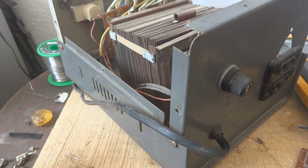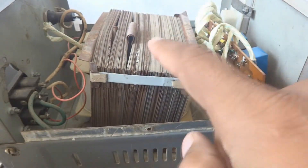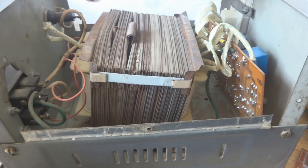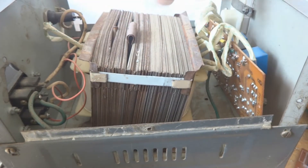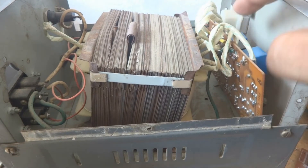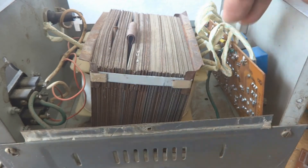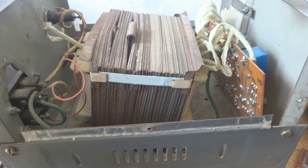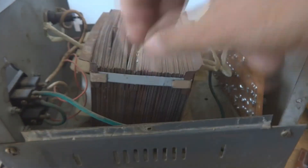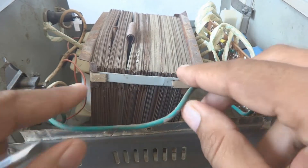Make a mark on the cover so you can reassemble it easily. Inside you can see a transformer — an auto-transformer with taping — and a fuse. Power comes through the fuse. There is a printed circuit board with components and relays tapping the windings. Here are the output sockets, and this green wire brings power from the PCB to the output socket.